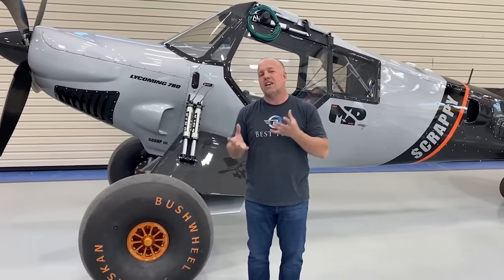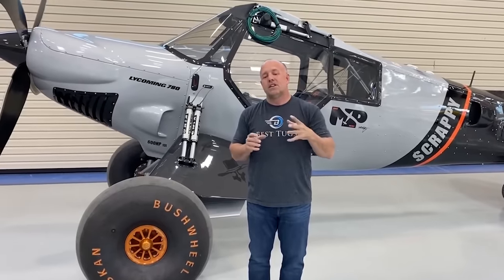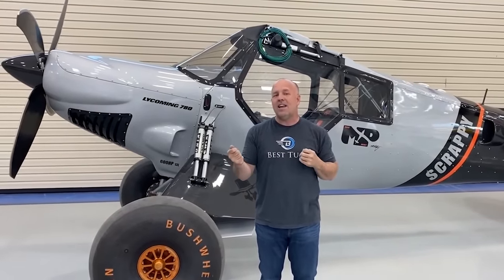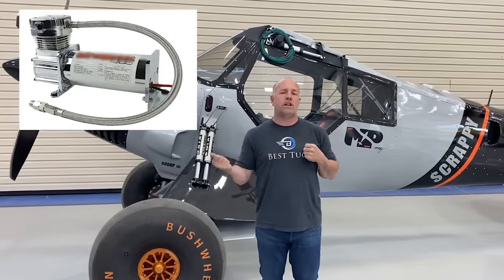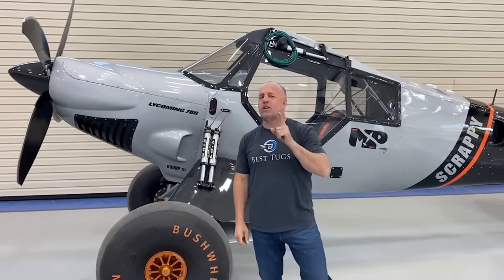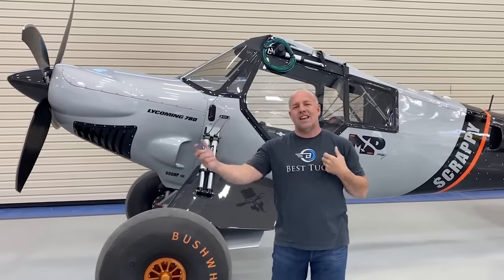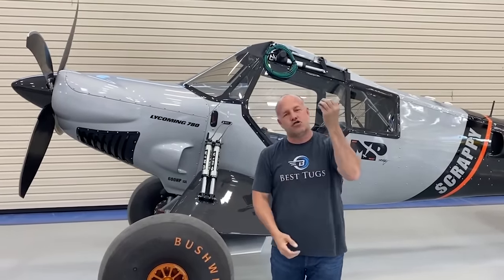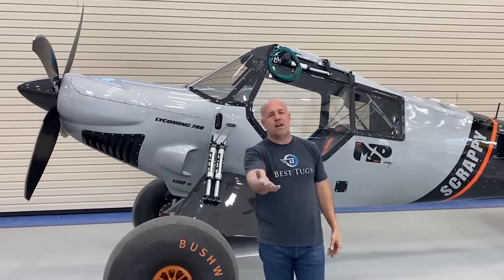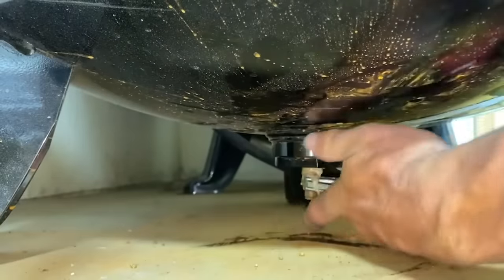I also couldn't use any automotive pressurized pump. Two reasons I can't use a pump. To get a pump big enough to hit the PSI I need, the pump would weigh about 150 pounds. Even a small pump is about 40 pounds but won't reach the pressure. But there's a much bigger problem to using a pump on board an aircraft. If I pressurize air, it takes in ambient air from outside, which has a humidity level. At a compression level, it will drop out the water into the tank, which is why your air compressors, when you spin off the bottom of the tank, it always dumps water.